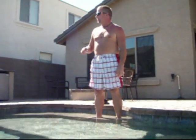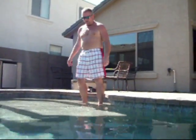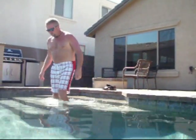So as with any of my electrical projects, and the ones you do at home as well, safety comes first. So we've already gone back to the electrical panel, shut off the appropriate breaker, double checked, made sure the switch is dead with my meter. So now we can start working on the light fixture, which is down at the end of the pool.